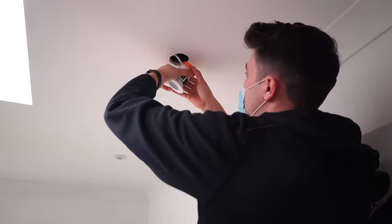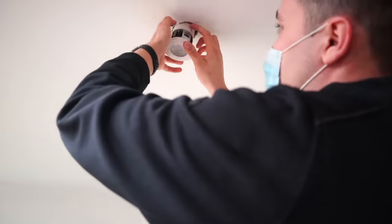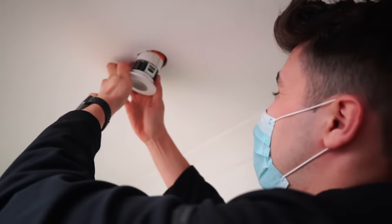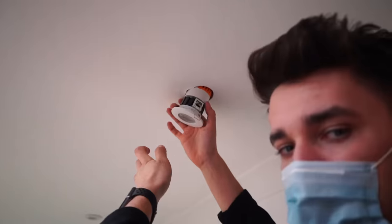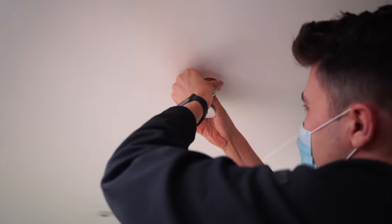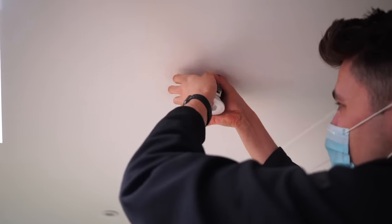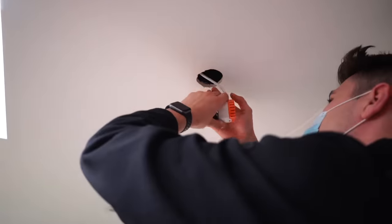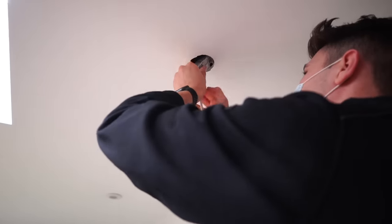A little tip when you're removing downlighters, because these are also known as sparky mouse traps. They get your fingers and they really hurt. Look at the force on that. Oof, there's some pain waiting to happen. So I always edge them out like that, and as I'm removing them, I grip there, and it also stops damage on the plasterboard. Have a look.